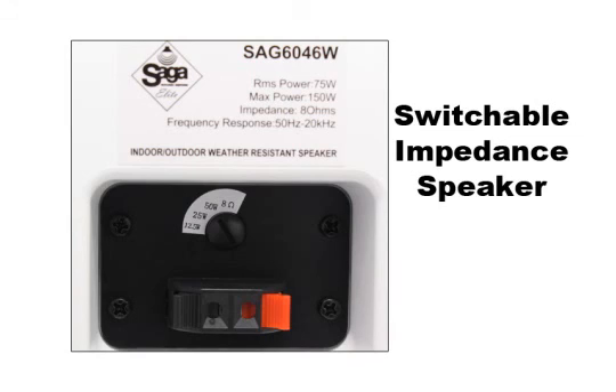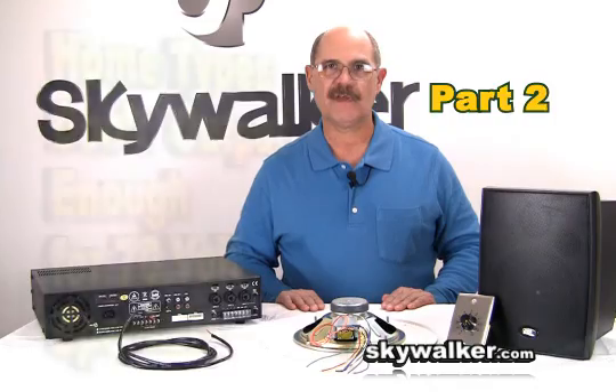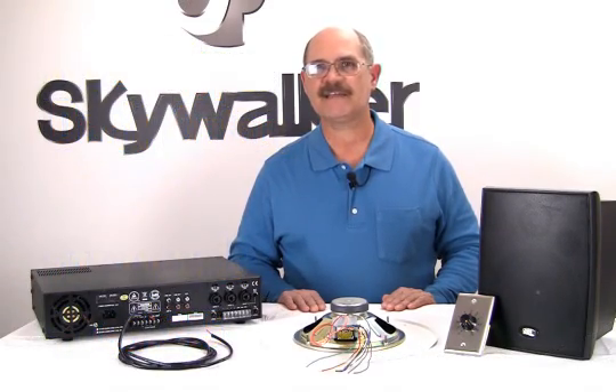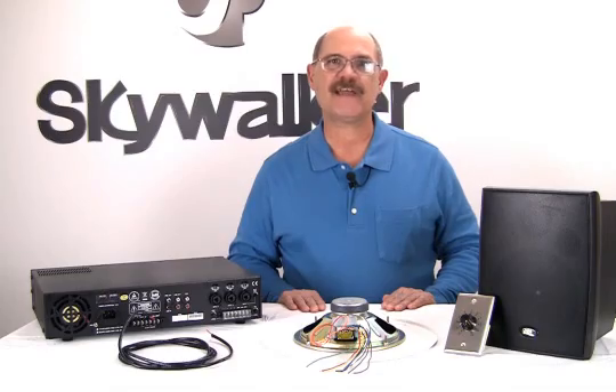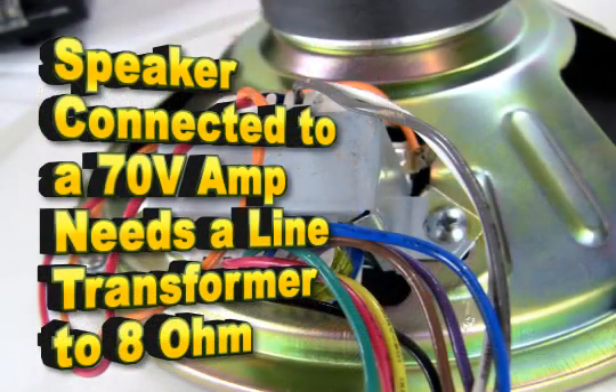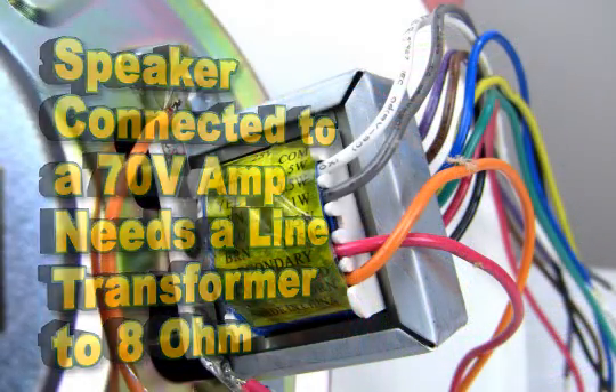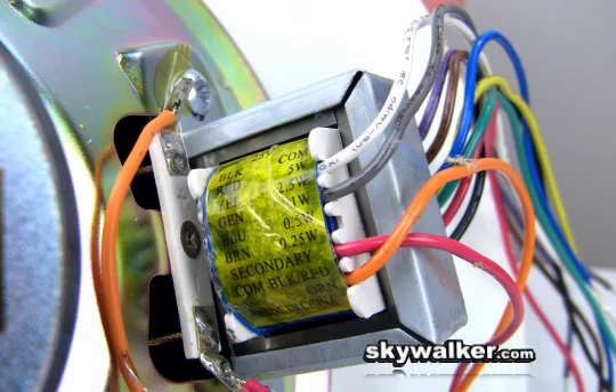However, many manufacturers now offer speakers with a switch to select 8-ohm or 70-volt wattage values, so these will work with an 8-ohm amplifier as well as a 70-volt amp. Home type equipment does not produce enough output voltage for 70-volt speakers to work at their desired levels. Good commercial design loads the amplifier to slightly less than its rating. Each speaker connected to a 70-volt amplifier must incorporate a line transformer to lower the voltage to a level that the actual 8-ohm speaker can use. This transformer is usually mounted to the speaker basket assembly of a typical bulk speaker.